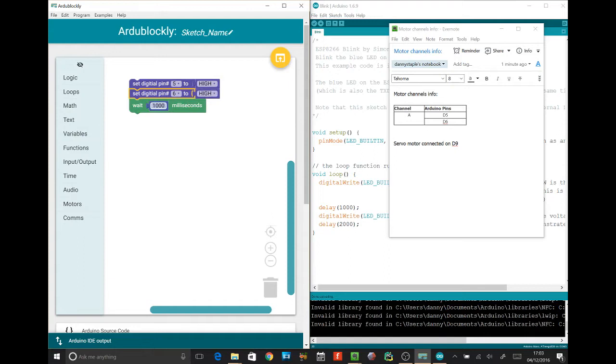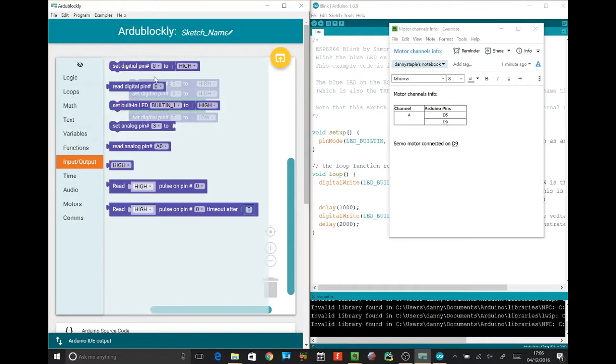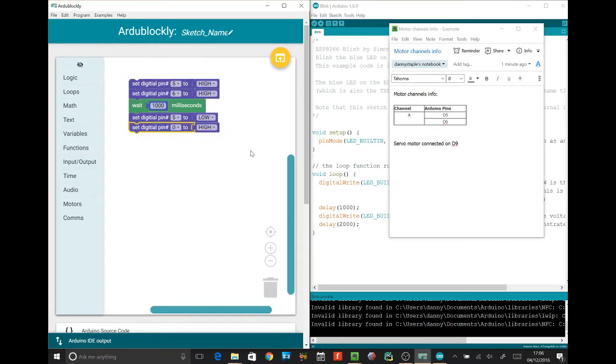I think we need to make it a bit smaller. This? Yep. Okay, and make it low instead of high. But why there's another piece there? Oh no, that's what we're telling it to set the pin to. So the first is which pin we're going to do, and then it's what level we want it, high or low. And we need to put this into a number 5. So we need to turn that low again. What do you mean? Well, if you read it, it says set digital pin 5 to high. Can you see that? Digital pin to high. The high to low. This? Yeah. And we've turned one of the pins off. We should turn the other off as well. Cool. Yeah. So drag that on again. Okay. So we've turned pin 5 low.